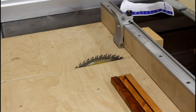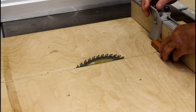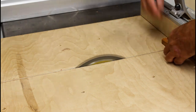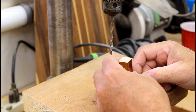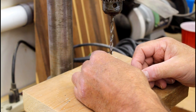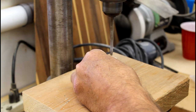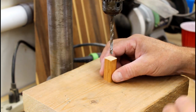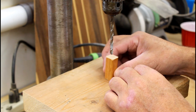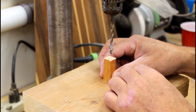I could cut the spacers by hand I suppose, but I'm just going to use my crosscut sled here — I've got my stop. As mentioned earlier, the bolts going through there are three-sixteenths diameter. I've gone up a couple of sizes in drill bits just so there's a little wiggle room inside for the bolt to slide up and down nicely. Because I've used my crosscut sled, I'm able to just stand the spacer on a scrap piece of wood here and drill. The natural thing would be to drill straight through the center of the spacer, however I want these to be set back as much as possible so they're not sticking out past the gunnel. Therefore I will likely just go off center a little bit when drilling the hole.